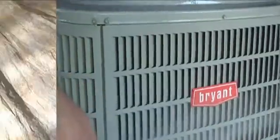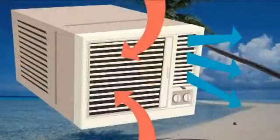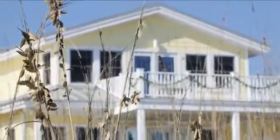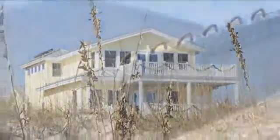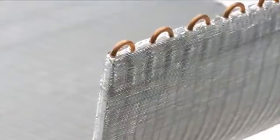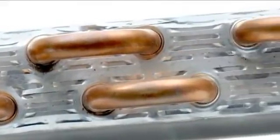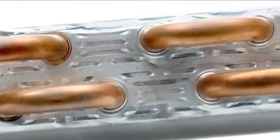So how does salt affect your air conditioner? Salt works to corrode the unit. Your air conditioner heat pump works by transferring hot air from your home to the outside. Homes close to the coast are naturally exposed to a lot of salt. Salt quickly gathers and forms a barrier on the coils of the outside unit, and this naturally reduces the amount of heat that's transferred. This, in turn, causes the conditioned air that cools your home to operate at higher temperatures.